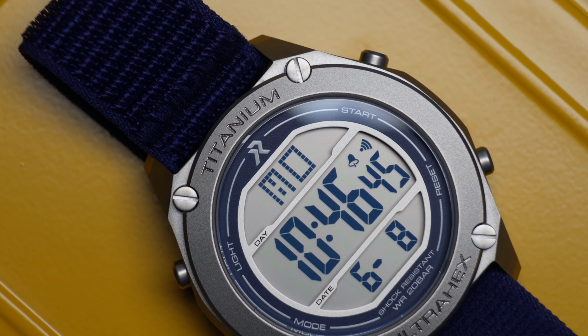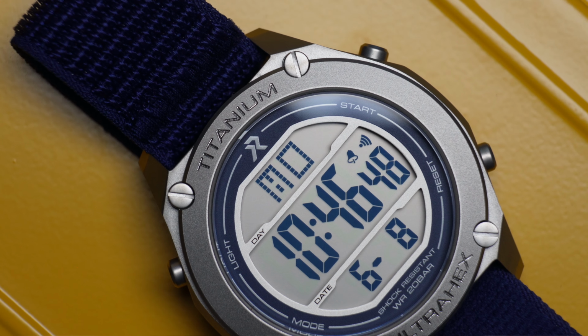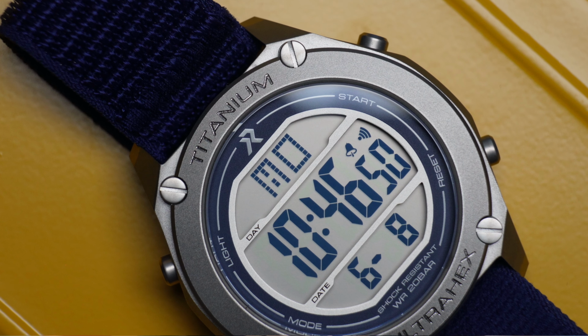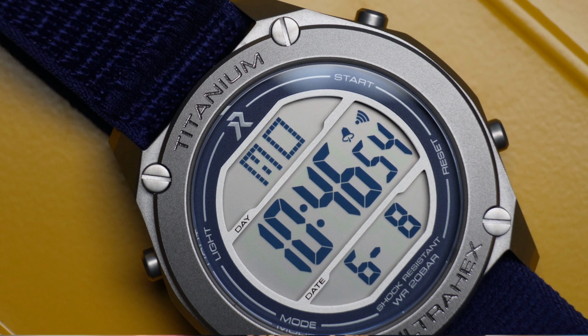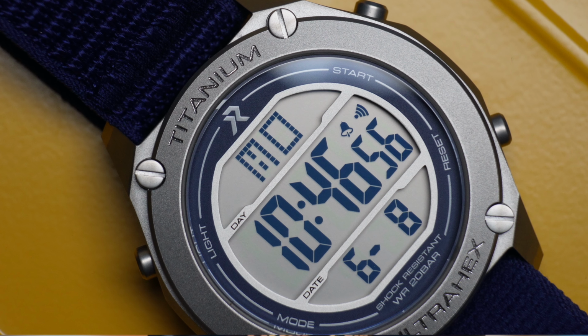There's levels to it, but in technical applications of titanium, it's almost indistinguishable. There is a marginal hardness factor as well as a marginal strength difference at the end of the day for grade 2 and grade 5. But after you hard coat it, the substrate level, which is where you're going to experience the most difference, when we hardness coat it, 1200 hardness factors, it's actually harder than grade 5.